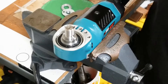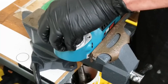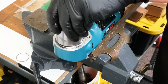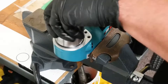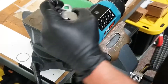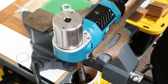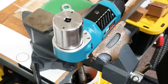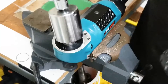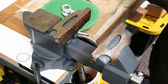Use your lock ring wrench to torque the lock ring into place. The torque setting is 23 Newton meters, which equals 203 inch-pounds or 16 foot-pounds. Set your wrench accordingly — on this wrench in foot-pounds, that's 16 foot-pounds. Tighten it down, and your grease change is complete. Reinstall any accessories or abrasives and you're good to go.